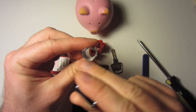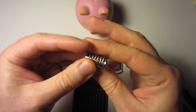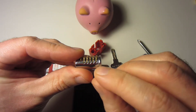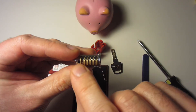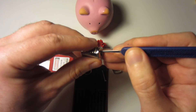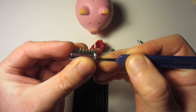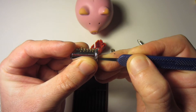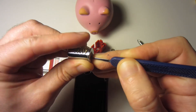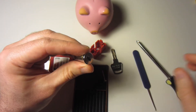All that's in the sleeve, besides the grooves that the sliders fit in, is a little track for the rotation limiter, which is on the front of the plug. There are 10 wafer sliders, each with its own spring, and the 11th one that holds the core closed when assembled. If you take a flat piece of metal and push all of them down, some go all the way flush, some stick out a little, and some stick out all the way — that's because there are three different depths of cut.